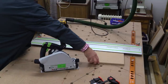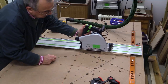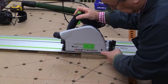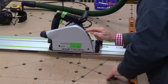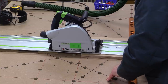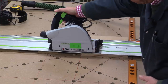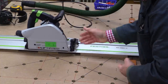In this case I need to establish my depth of cut first. You can do this by establishing where the surface of the material is with the saw blade, then adjusting the depth of cut accordingly — so the saw blade is just touching the top of the material. I've got a choice: I could go down eight millimeters on my gauge here, which is simple because it's on seven, so I just need to go to 15 — seven from 15 is eight millimeters. Alternatively, I could have my piece of stock with a pencil mark on the side and check that was at the right depth. So two methods of setting the saw up for the cut.